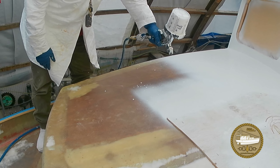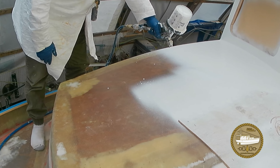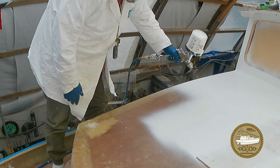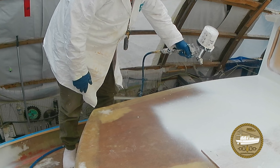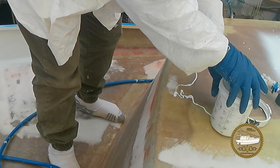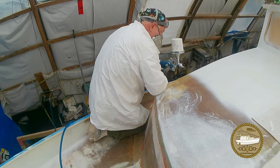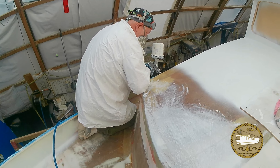This is where the issue with the paint cup leaking really started to accelerate. You can see drops of white paint on the surface. I should have probably wiped them off, but this whole surface is going to have to be sanded anyway before the next coat is put on. It's a little peculiarity with this cup system — it has a disposable liner that eventually develops a vacuum, and you have to learn how to burp the cup to prevent that inner liner from collapsing. That's what caused the spill.